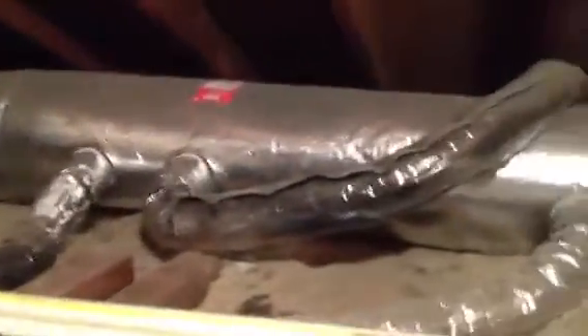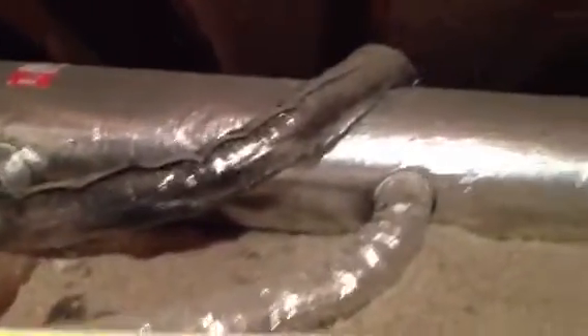Scanning around here in a clockwise direction, we see the skylight enclosure actually does not have any insulation on it that's visible here. That's pretty unusual, and that would be an easy way to make the home heating more efficient. These are the supply ducts for the high velocity air conditioning system.